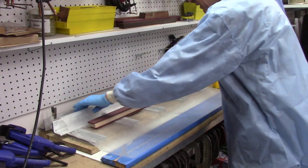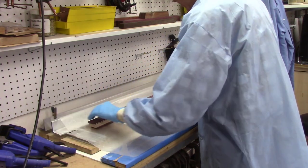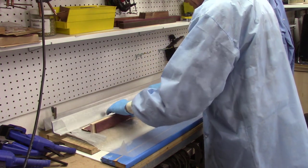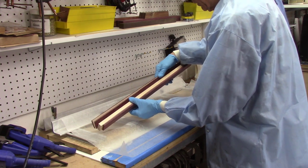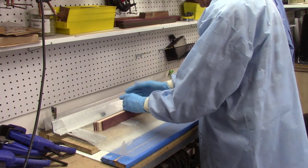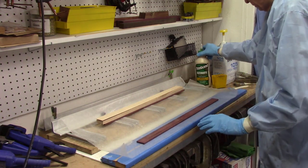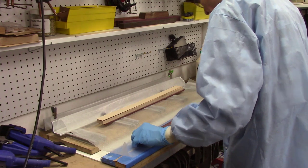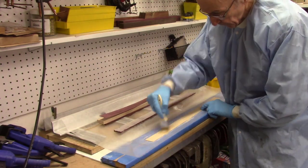I'm using my glue jig system to glue these up, with wax paper placed inside the jig. The glue jig consists of two angle irons that run on rails to keep everything nice and straight. I'm starting with the purple heart board, which is symmetric — purple heart, maple, thin purple heart, and a center strip. Since I'm cutting two edges from a single board, the boards have to be symmetric. I'm applying Titebond 3 glue with a brush on both sides of the boards for good coverage and tight joints.